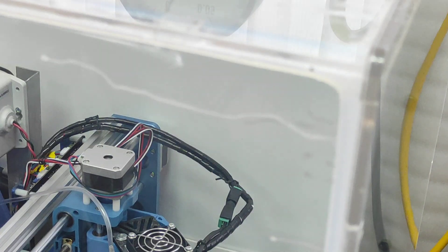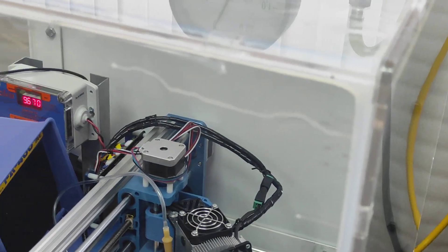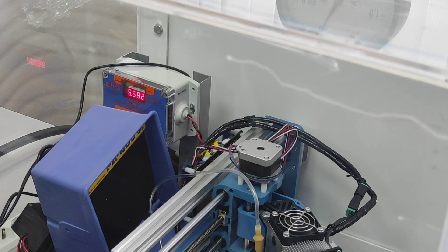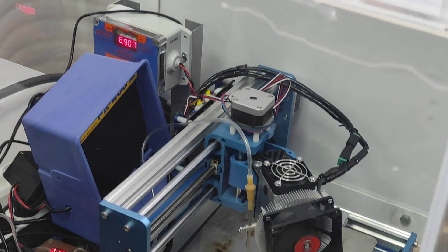Pavel is adding CO2 inside the chamber and you will see that the concentration of oxygen is getting lower. So now you see that it's reducing. An optimal level is probably something like 5%, though even 9% is okay. Let's make a test and see how accurate we can do laser cutting with low oxygen concentration.